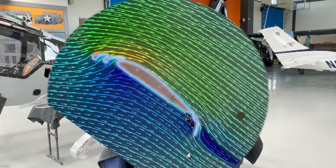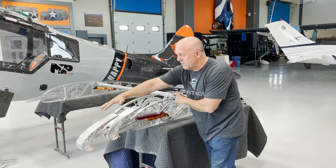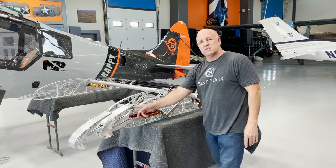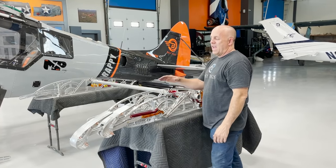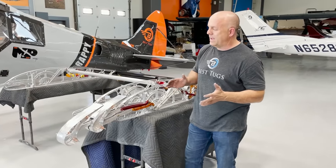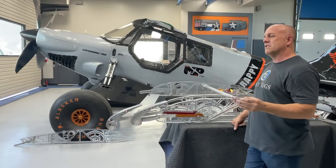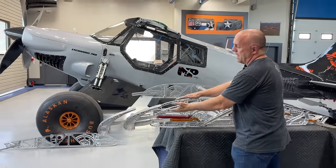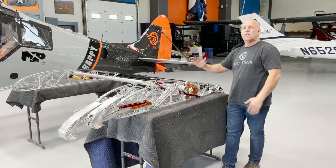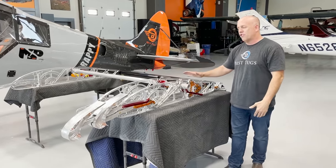However, when I compressed the air and sped it up, it's trying to drag the relative wind up to its airspeed. The airspeed coming through the compressed zone is much faster, and then the air coming over the top is slower, and when they meet, they blend. What I realized actually blew my mind: on the flow analysis, I started to find that as that air blended, it sped up, and then it started to re-pair up with relative wind, or the aircraft's true airspeed, as you got further back.